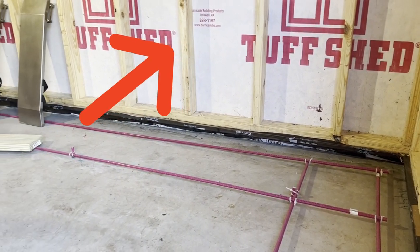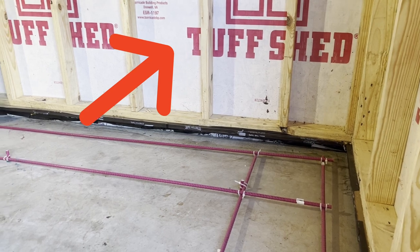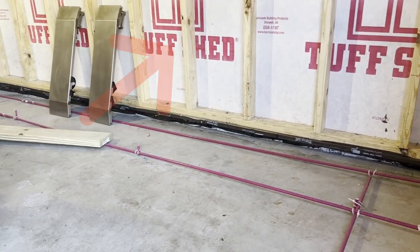You're going to have existing stud bays in your shed, and then you're just going to take two layers of 5/8-inch drywall, cut them so they fit inside the stud bays — not creating a separate wall, but going into the stud bays. There's a specific way of doing this. I want to show you a diagram from Rod Gervais's book 'Home Recording Studio: Build It Like the Pros.' I have a link below and highly recommend this book. Rod mentions this toward the end of the book, but it's an extremely important point for anyone building in an existing structure who wants to beef up the existing outside wall.